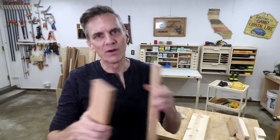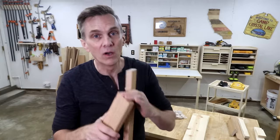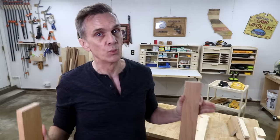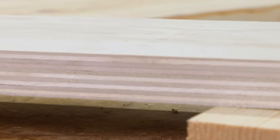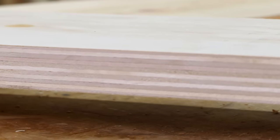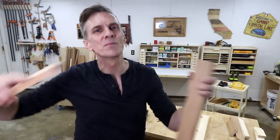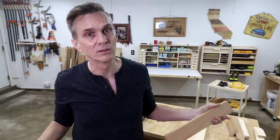End grain is very porous, and glue alone will create a very weak connection. Dealing with end grain is one of the fundamental challenges in woodworking. This includes plywood edges, which are also fairly weak when only glue is used. So these connection points need some sort of reinforcement, either mechanical, like say using screws or nails, or by shaping